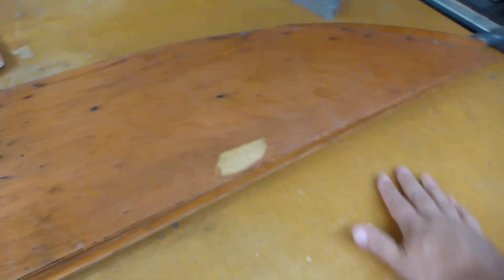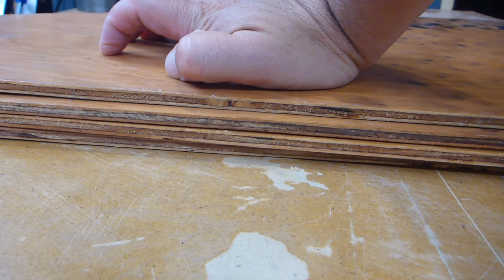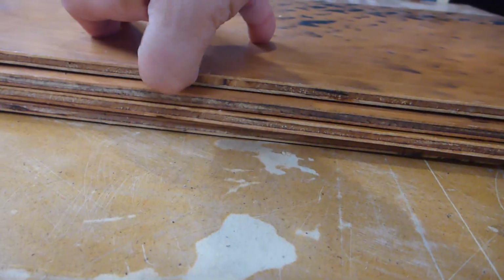So, you know, you have some seams going that way, and then this one's skinnier this way than this one. You know, has the curved part being the thicker part. So those seams are bridged, and then you have the one that's just split right down the middle. So, with some creative applications of wood screws while the epoxy is curing, I think I can get this all sucked down good and tight with filler material in between epoxy, and make a good solid transom.